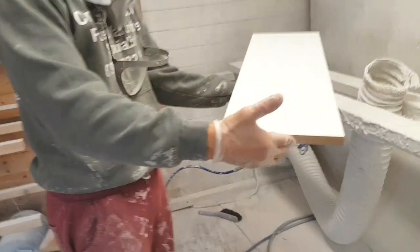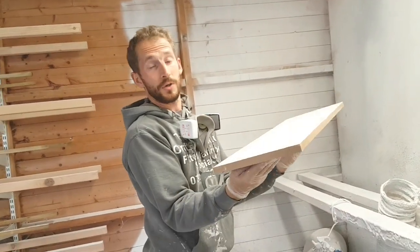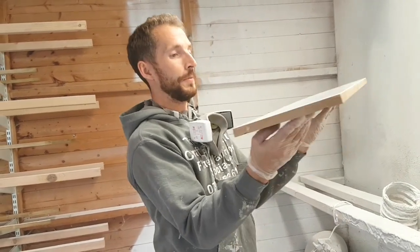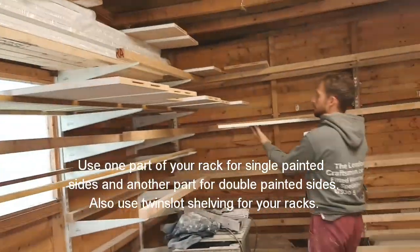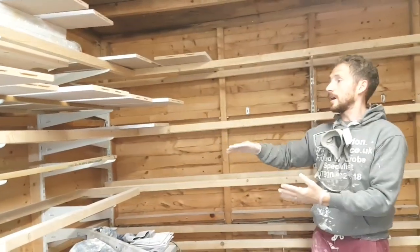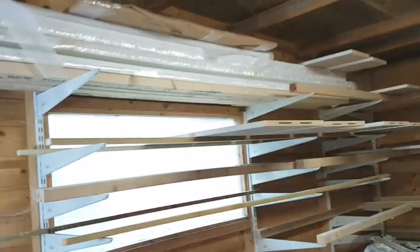Can you see it in the light? Can you see the edge? That will go in the drying rack for a few hours — because it's water-based paint, we're using an acrylic water-based primer, John Stones. We put it in the rack — this is all our racking here, purpose-built on twin-slot racking. What I generally do is put stuff that only needs one face done in one part of the rack, things that need to be flipped on another side in a separate part. This side is for long pieces, this side for shorter pieces. A few bits have been done — it's as simple as that.